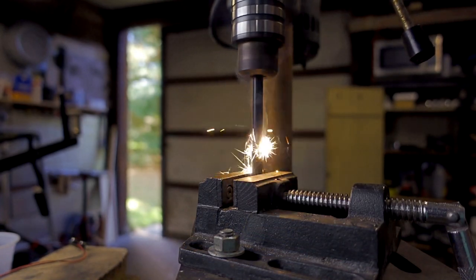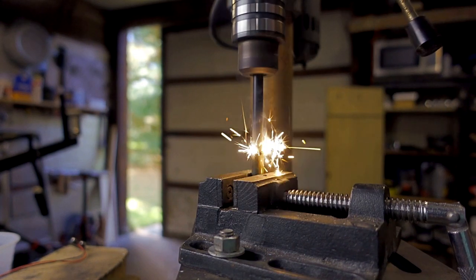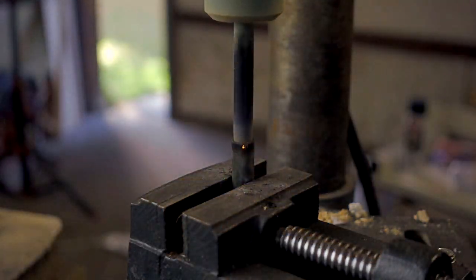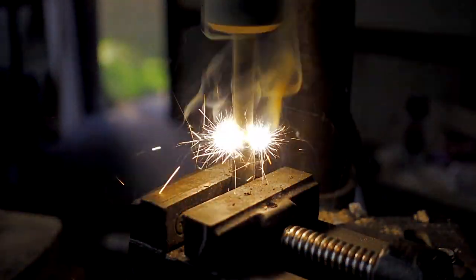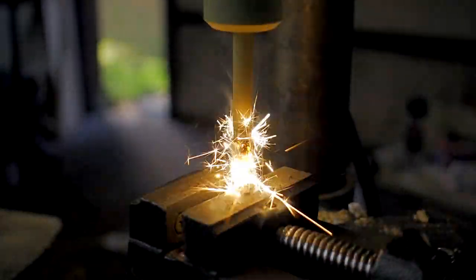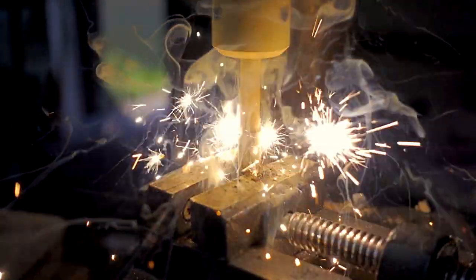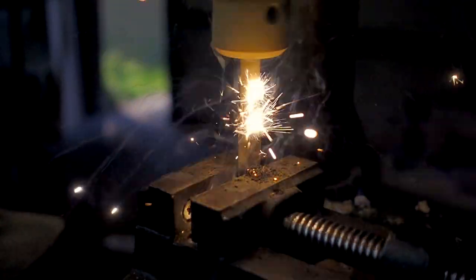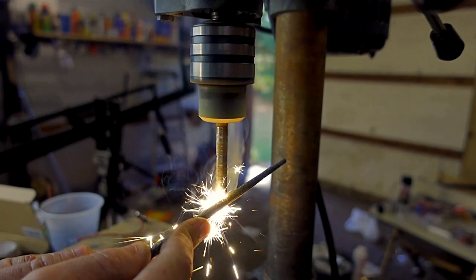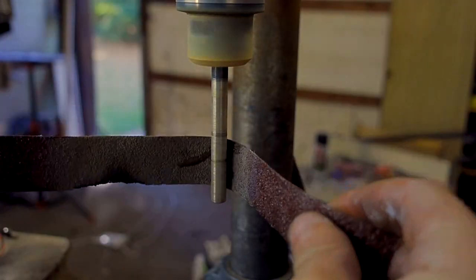This proved to be very exciting in my first attempt, which was to take a tiny bit of the metal tubing that was to be my barrel, cut a little groove in the top, and use it in a vice on my drill press to slowly shave the metal rod down as I fed it through into the tubing. This sort of worked for a while, but the tubing got too hot and deformed, causing the ferrocerium rod to stick inside. My next step was to try using a file.